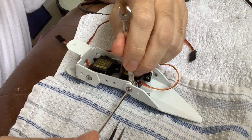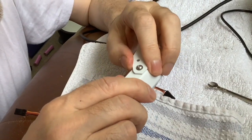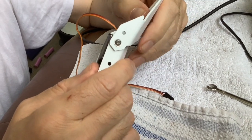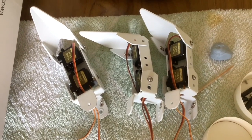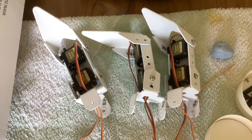You can wind it up all the way and then back it off a little bit until you get the right tightness — as tight as possible without actually restricting the servo. So that's the whole leg there. And then after that, you did these three remaining legs in exactly the same manner.